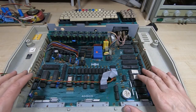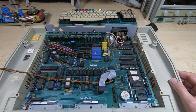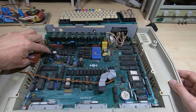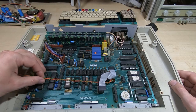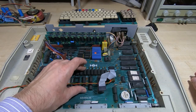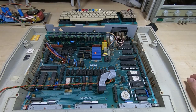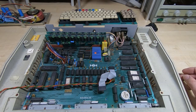We've got the main board exposed and I've got all the screws out. I have to say on first inspection I'm not holding out a lot of hope for this particular machine - it's obviously had a long life and has not been stored in particularly good environments, so there's a lot of corrosion. Some of the pins have just completely corroded away. There's a connector that's supposed to be here but where it meets the board the pin is almost completely gone. A lot of the IC sockets are extremely loose - I'm assuming they will just pull off if you were to put any pressure on them. All of the IC pins are extremely rusty.